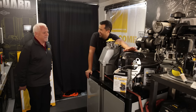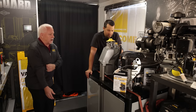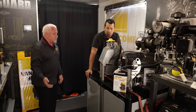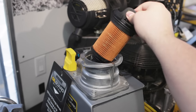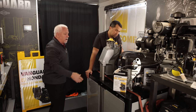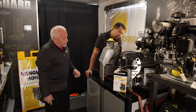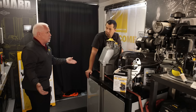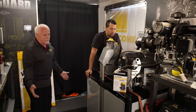So this is the engine on my personal mower actually. This is the 40 horse EFI. What can you tell me about the oil guard system? Well, the oil guard system is based on a dry sump system similar to race cars. It puts a minimal amount of oil in the bottom of the engine to make it run efficiently, then pumps the oil back out into this reservoir here. The reservoir has an automotive style filter so you have more capacity to catch the dirt. Then it works its way down through this aluminum five quart reservoir. Aluminum has cooling capacities, so as it works its way down through here, it's cooling about 30 to 40 degrees. Then it's reinserted back. So keeping heat out of the engine gives the oil better health, the engine better health, and the five quarts — six quart total — gives you the longevity of a 500 hour oil change. Saving on cost of ownership, less downtime — it's a great option.